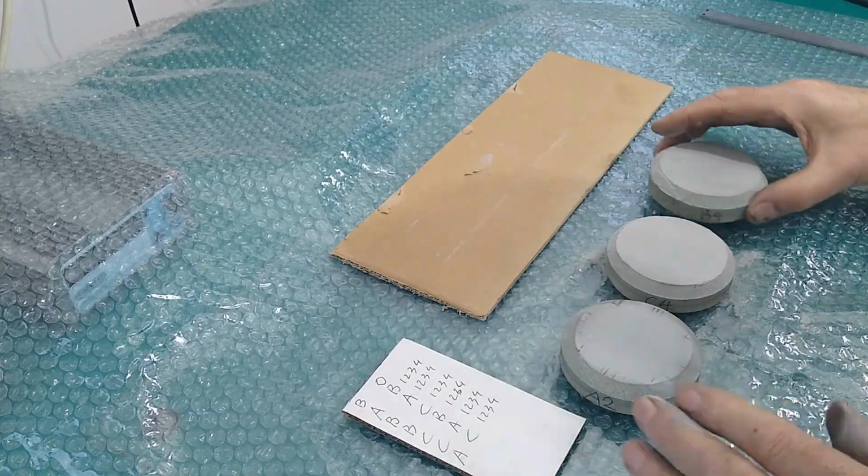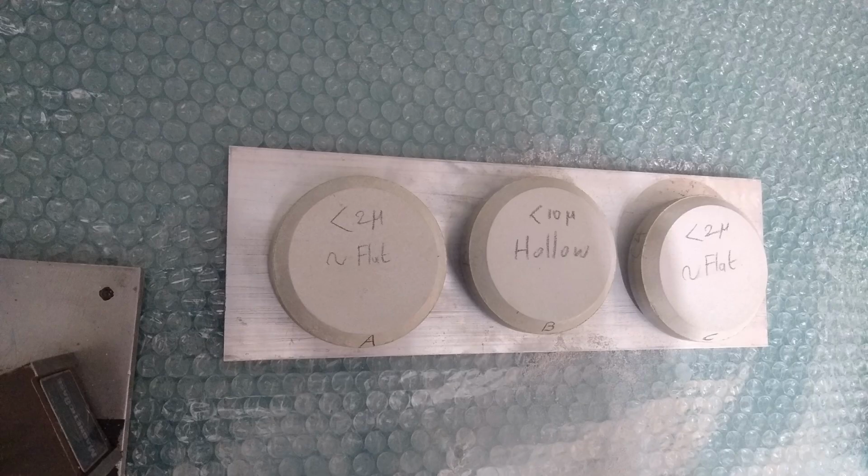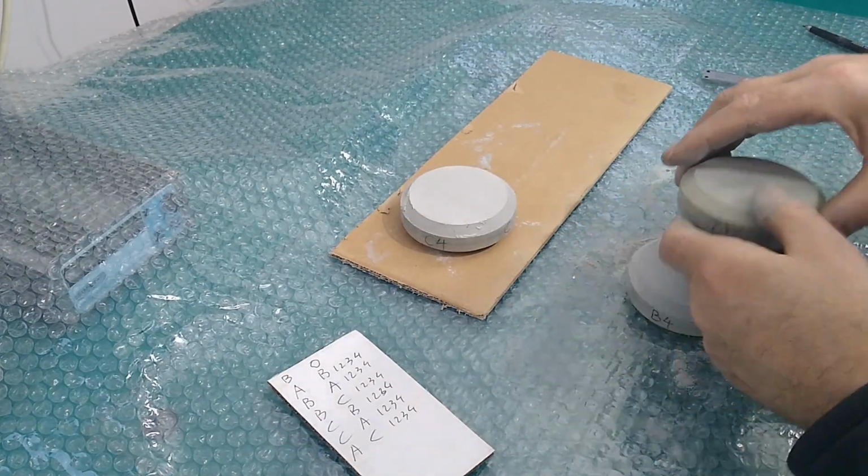After 4 rounds of these grindings, the deviation becomes too small to reliably measure with the somewhat curved caliper leg. So here I very carefully examine the deviation with the straight edge ruler. Remember, this is for demonstration purposes only. The curvature of the caliper leg comes in handy now. I can estimate the error in the curvature of the stones by placing it with the concave or convex side on the stones. The fourth round of grinding, I suspect this will be the last.